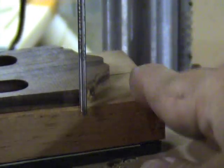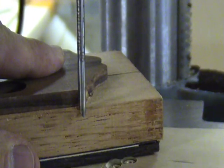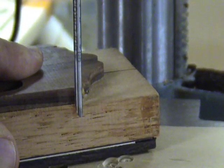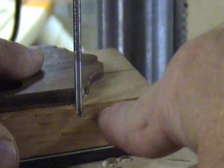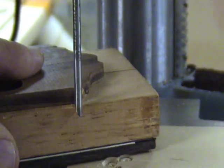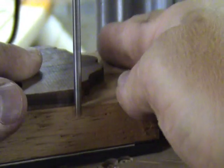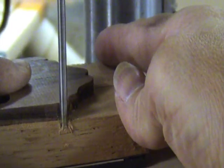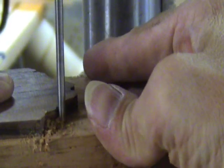Something else very important to remember is that the shaft of the tool is functioning as the bearing on the router bit, riding against the side of your template. So the template must be firmly attached to the neck — we don't want it to move. After making a few passes around the template, the tool has cut deep enough that it is now riding not only on the template but on the new surface you've just cut into the headstock.